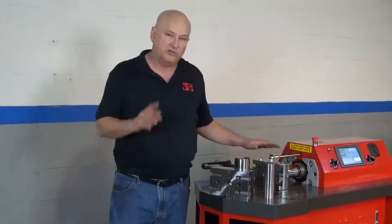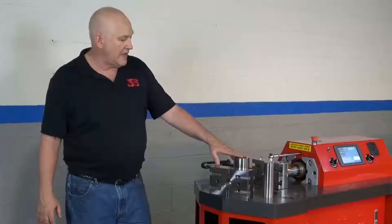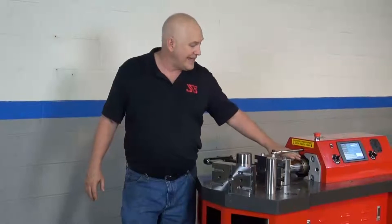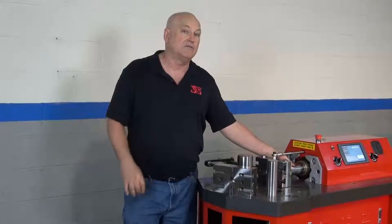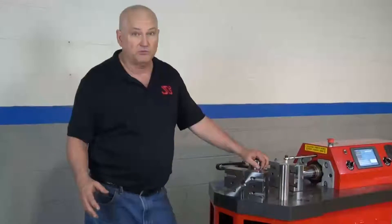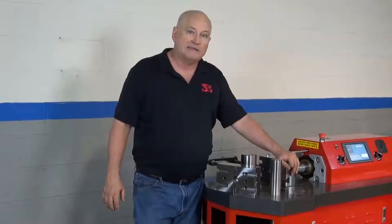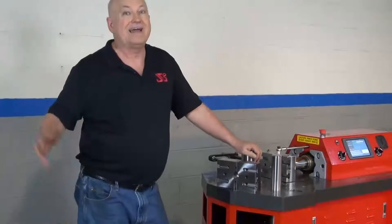The machine is rated for 6 inches of tooling height. The important thing to remember on any tooling application is to keep the load as near to the center of the RAM as possible. If somebody ever calls and says they bent the RAM, that is an absolute user error not covered under warranty. There's no way to bend that RAM unless the user bends something drastically off-center. Always try to bend near the center of the RAM and the machine will last for decades.